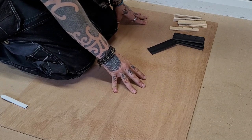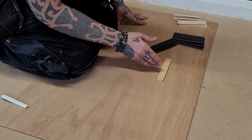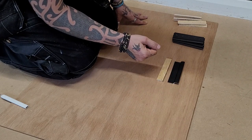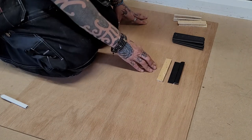British Standards recommends that the gripper is cut down to 150mm lengths. These lengths are actually to accommodate any slight undulations in the subfloor. If I put a full length down, the Z bar is 1.8 metres, I'm actually compromising the amount of contact with the subfloor dependent on the undulations. So again, just cutting them down allows you to get a better fixing.